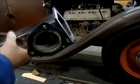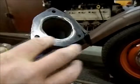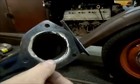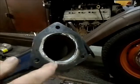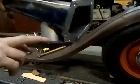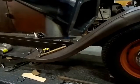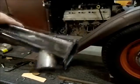So here's the bottom end. Again, it's the same thing. I've run the weld around the inside with the tube being recessed a little over halfway in the flange. Gives you a nice strong area, and it doesn't dirty up the outside of the pipe where your weld goes, get in the way of your bolts and stuff.